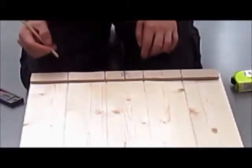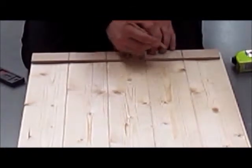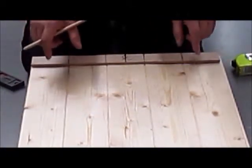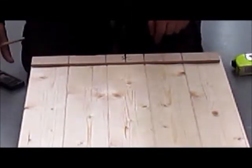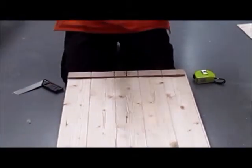The next stage is to pick up the joint lines on each board. So what we're essentially doing is marking the dimensions of the T&G onto the gauge rod. Then we can take the rod up and manipulate that on the wall to establish our starting positions, as opposed to trying to do it with 4 or 5 boards up on the wall, which is very, very cumbersome.